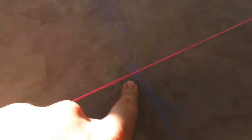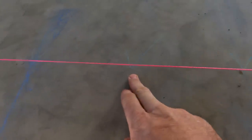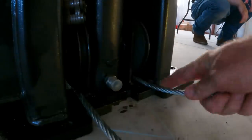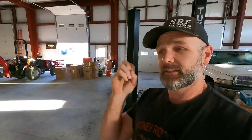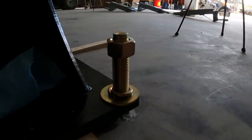Here's our line for where the edge of the post is going to go. We've got chalk lines marked and a center mark — the base is approximately 18 inches wide. The thickness of the concrete here is about six inches, fiber reinforced, really strong. You need to read the specs: this lift requires at least four and a half inches of concrete thickness, and the anchor bolts need to be set at least three and a quarter inches deep — we're set to three and a half.